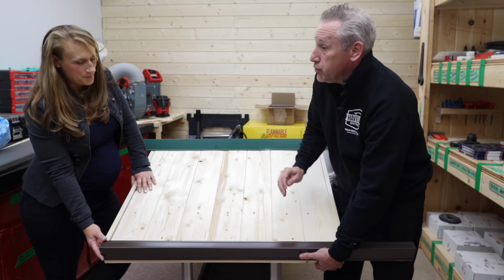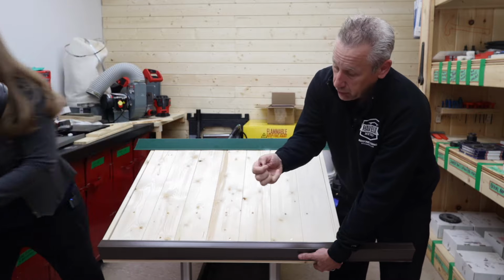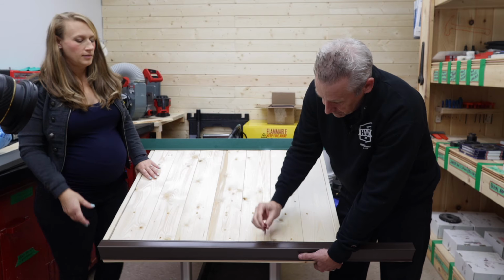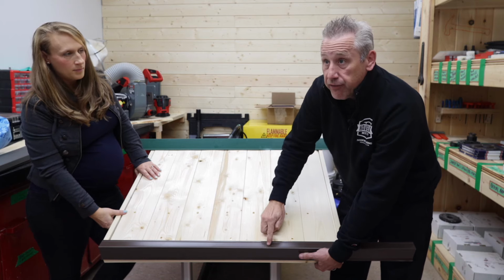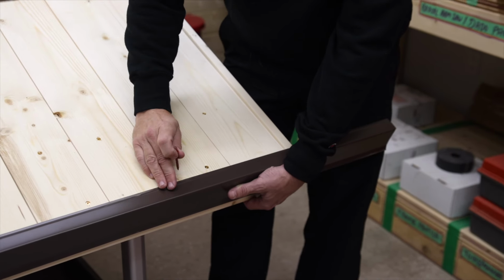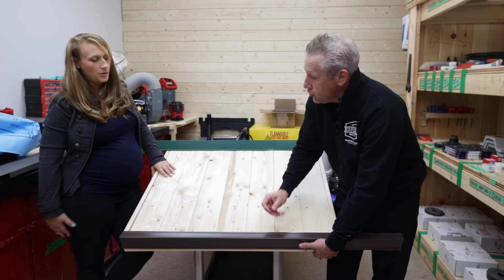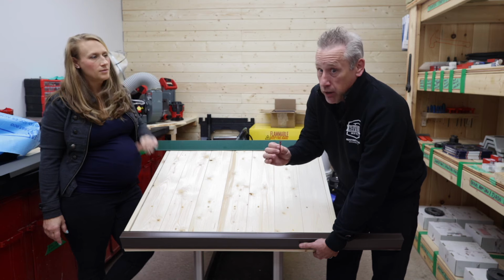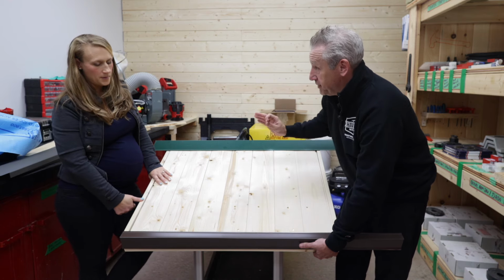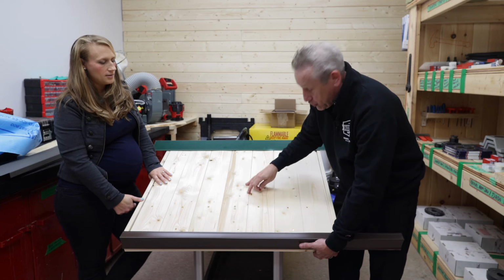So nothing's going to stand up. There's also the traditional roofing nail, or the roofing screw, which you'll see with the grommet in it. The problem is if you use these, you have it sit above the edge. And when your sheet comes across, if your actual rib catches the top of this, it's going to sit funny and proud. It has to sit flat. So we don't want to use these screws anywhere except for the actual sheet and to put the ridge cap on. Everything else needs other fasteners. This is the only thing you're going to use for the actual sheet or the ridge cap.